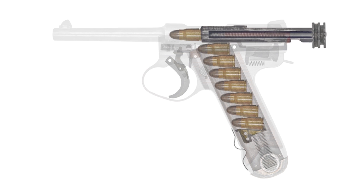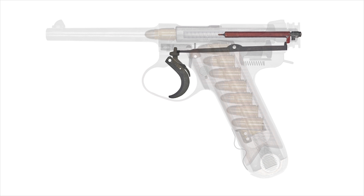Take aim and a squeeze of the trigger will lift the sear, which in turn lifts the front of the trigger bar. Situated like a teeter-totter, the rear of the trigger bar will now lower. This releases the striker. The firing pin strikes the cartridge's primer, discharging the pistol.